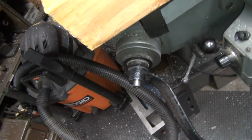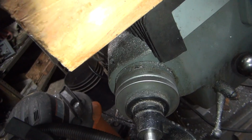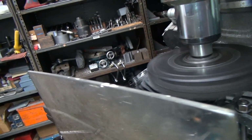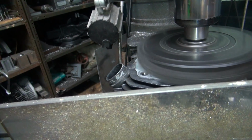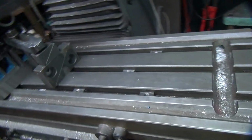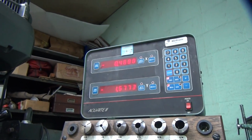Okay, now you got your safety glasses on, right? Good. Well, big deal, I can't see crap. Okay, I'm gonna give it a couple more thou here. Behind, okay, there's three thou. Root down. Feed it back. Now the chips are going that way. Still got a big low spot. Back to zero.